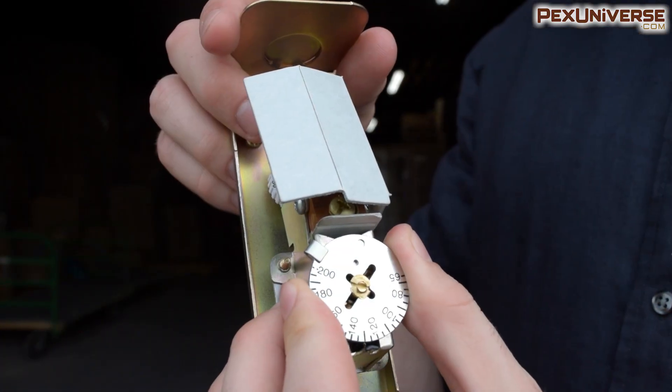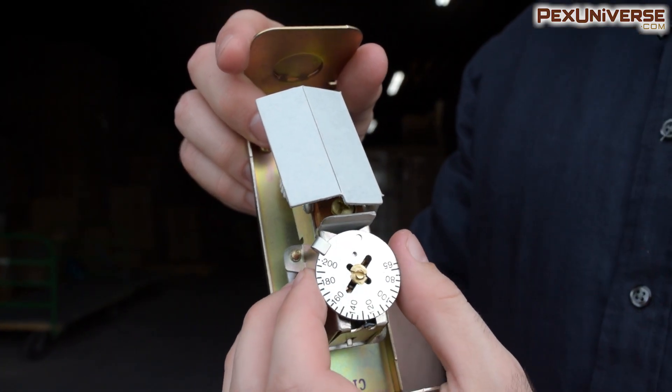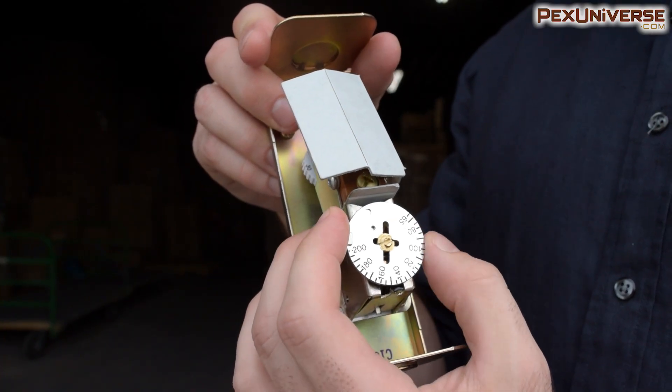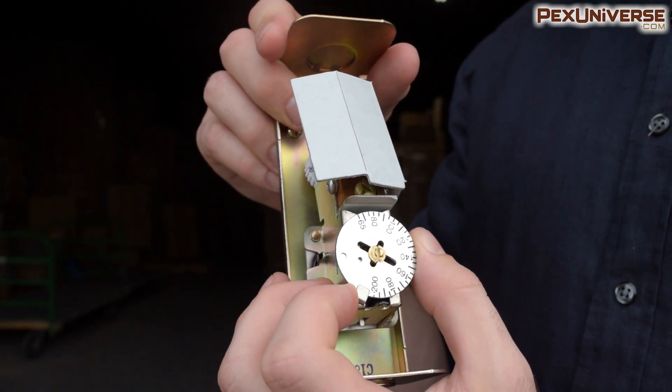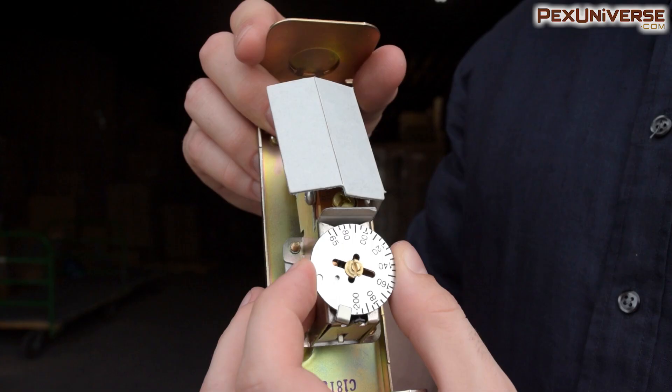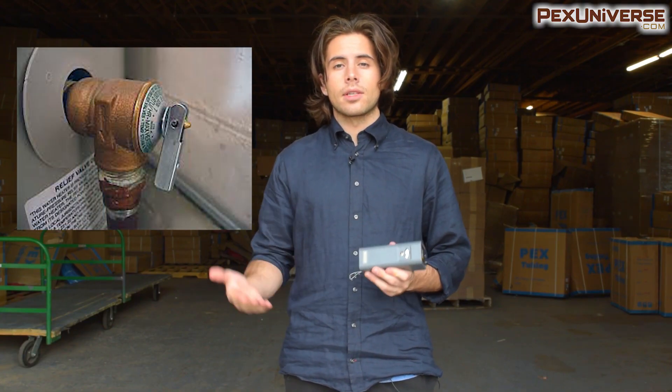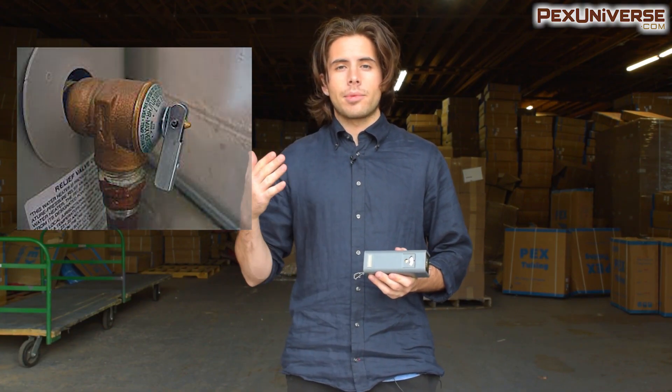Since this is not lab-grade equipment, these settings are not perfectly accurate. For this reason it makes sense to set the high limit to around 200 degrees, but watch out — setting the high too high on the Aquastat can result in over-temperature in the heating boiler and can result in dumping water. If your temperature and pressure valve was not leaking before and then begins to leak after you set up the Aquastat, try lowering the temperature by about five degrees and see if that changes anything.